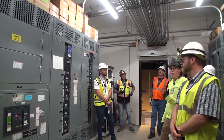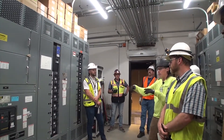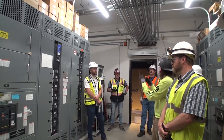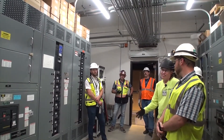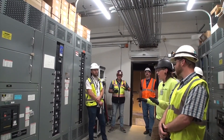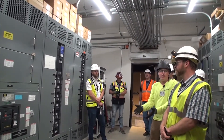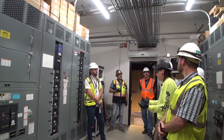Just so you all are clear with the rapid shutdown — the DC part of that system is still hot, especially if the sun is out. So don't think that when you turn that off, you can just go unplug the panel because it won't be live — it will still be live. The panel is always hot if the sun is out. They're producing power — you can't turn those off.